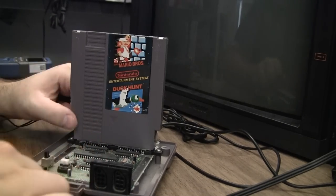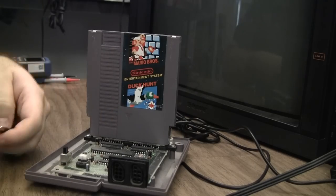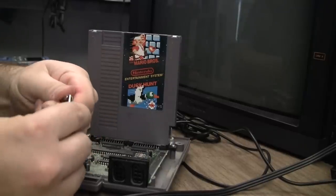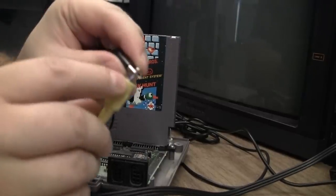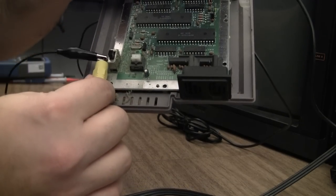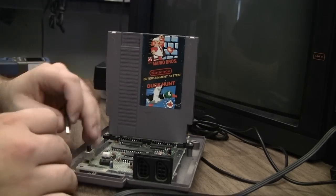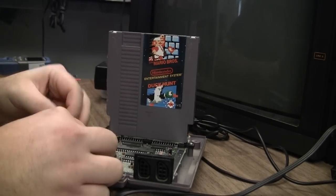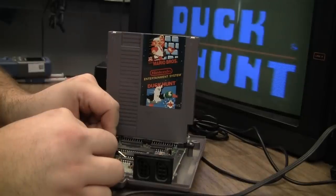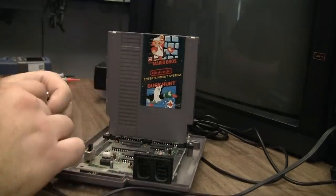Now what I'm going to do is tap right off of the PPU pin 21, which is composite video output. I'm not going to use the amp or anything — I'm just going to connect an alligator clip lead to the RCA jack, hold the grounding part of the connector to the power switch, and touch the other end to the PPU. And look at that — we have color video. It looks dark and bad because it's not amplified, but it's color. That tells me the RF modulator is bad, and once I do the AV mod, everything will be fine.